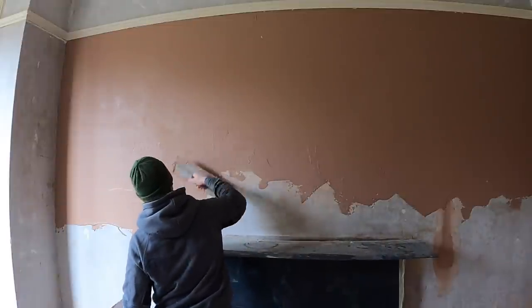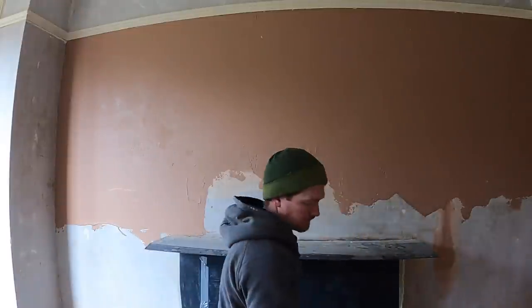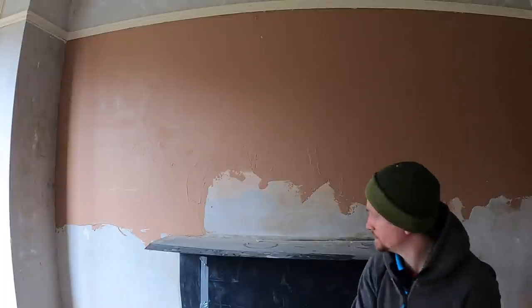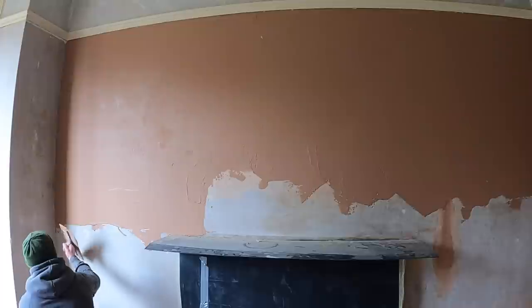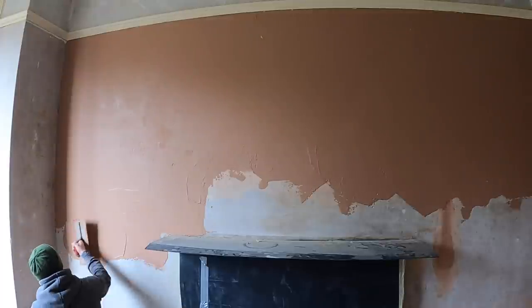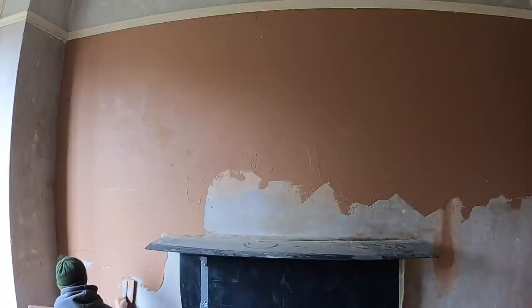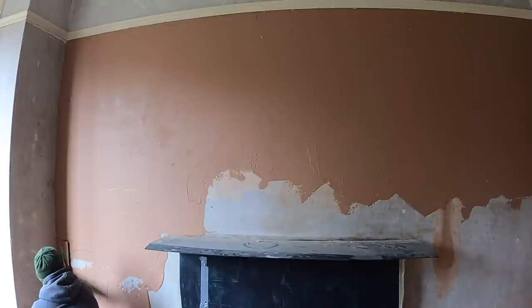It just means it's a very fast hit. It's usually 2.5 to 3 hours, because you are using the same batch of plaster for both coats. And it's not a problem doing it that way, because I do get asked, is it a problem to use the same batch of plaster? It's not. You've just got to be a bit faster than usual. As you could imagine, the plaster goes off.